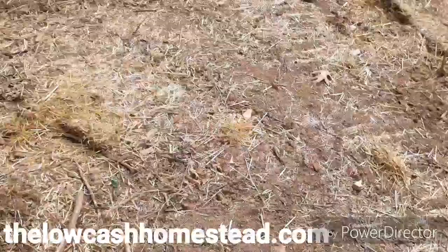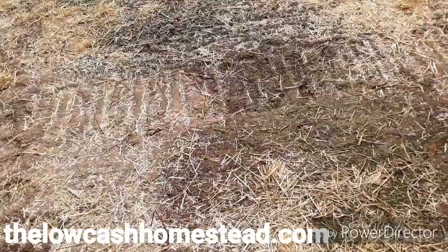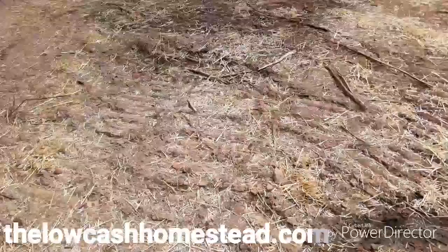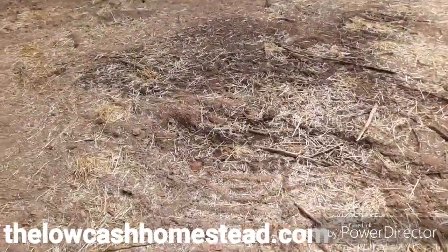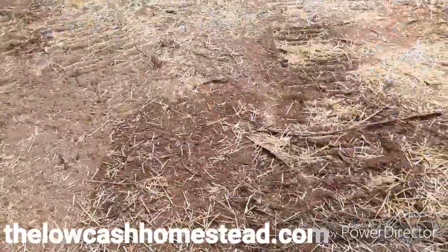They have our new septic system installed. What we're looking at now is where they reseeded everything. They did tell me the ground is going to be a little bit wet until all this grass grows, because the way this works is these lines are eight or ten inches down. They're pressure emitters with vacuum breakers, and a dosing pump comes on, feeds the lines — some of it goes down and then the grass and grass roots help to evaporate it.